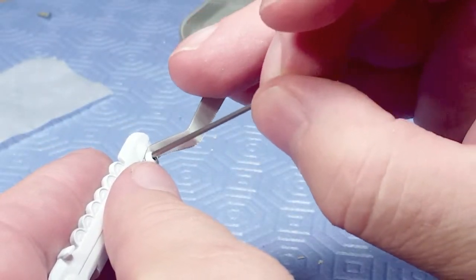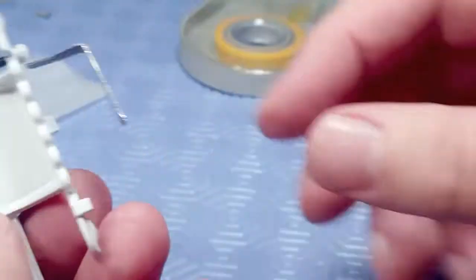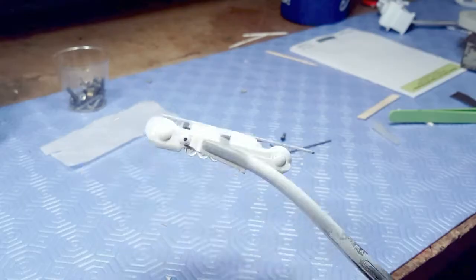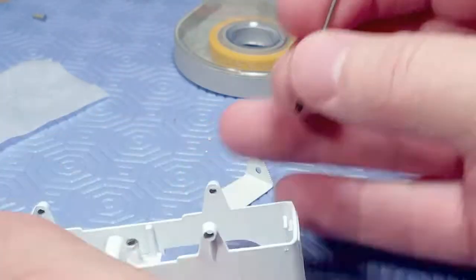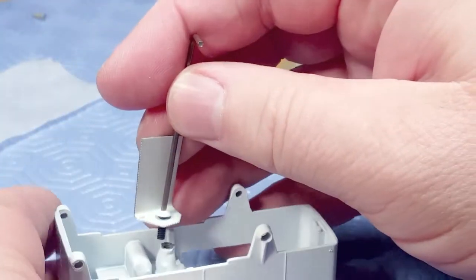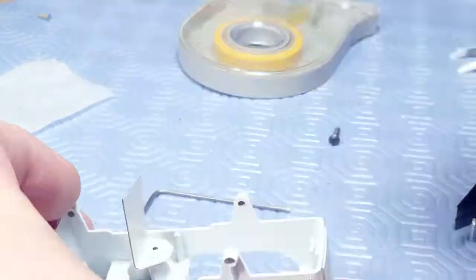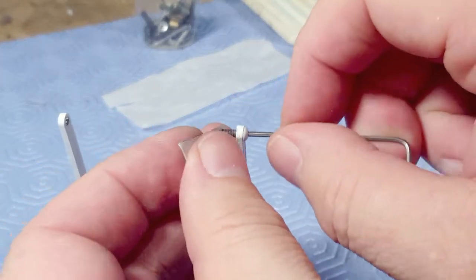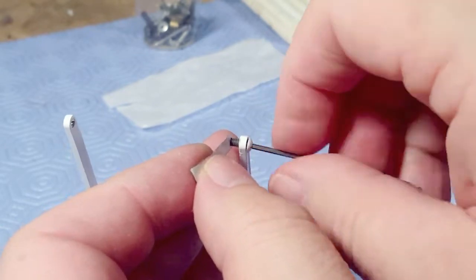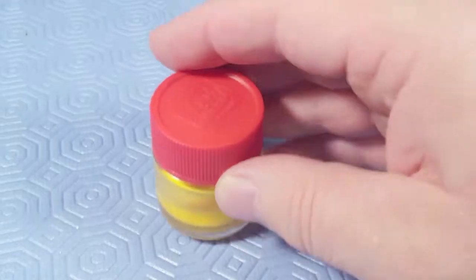Here I'm trying something new — I think I'm going to do this from here on in. I've got a little piece of steel from the siding that I use for bases and stuff, and I screw that in so I'll be able to use it to hold onto the part when I'm painting it. I'm going to do it with all three castings. I made up these little brackets and screw them in with the cap screw like I would if I was putting in a steel base. That gives me something to grab onto — it holds really well and the hemostats like the thin material. This is my solution because otherwise it's very difficult to hold something like this shovel.